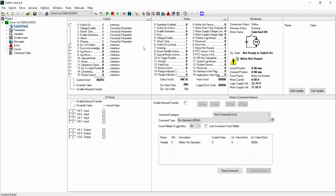This trigger move is commonly used to replace pneumatic or other two-position applications controlled with a 24-volt I/O. This move is more commonly known as a trapezoidal move. This move requires position, velocity, acceleration, and a deceleration. Triggered means that the system will make one move, typically out, when the trigger bit goes true, and another trapezoidal move, typically back, when the trigger bit goes false.